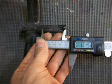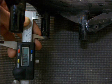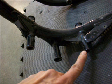On the left motor mount, we're going to be marking at 1.5 inches in, and on the top left motor mount, we're going to be marking at, I believe this is 1 inch in, exactly 1 inch in. And on the bottom left motor mount, shown in this image, we're going to be cutting off a 1/2 inch. So you're going to use the dial caliper at those measurements.